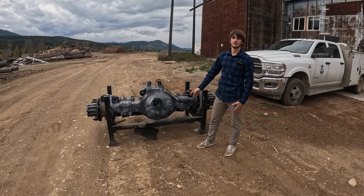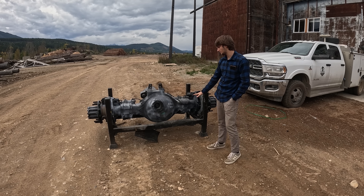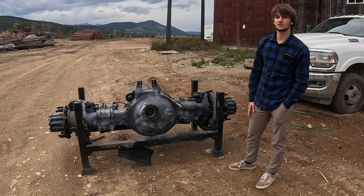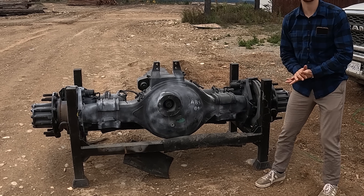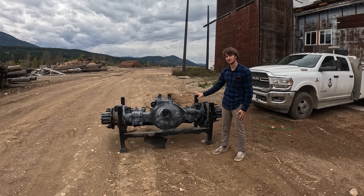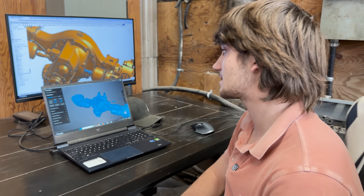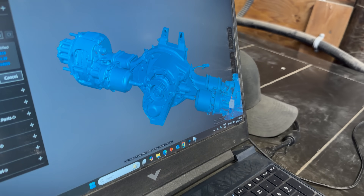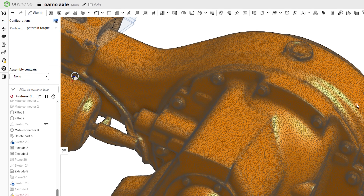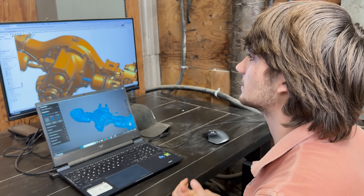This is the axle for the mechanical truck. We unfortunately don't have a 3D model yet, but we're going to get one in-house based on a 3D scan we're going to take of it. We need the 3D model to design the suspension brackets and the torque rods with the correct geometry. You might notice this terrible paint job — it actually serves a purpose and comes off. It's only to have a better quality scan; it makes the surface opaque so that the light does not reflect and make shadows for the 3D scanner. Now we're back in the office with the 3D scan in the computer. This is what it looks like on the 3D scanning software — we have about 1,566,451 triangles. We imported this model into Onshape where you can actually see the triangles, and they look beautiful.